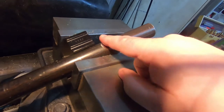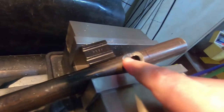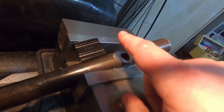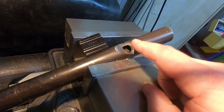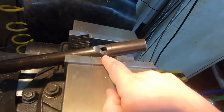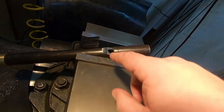Came out looking pretty good. I'm still really loving the roughing end mill I've been using. The cuts on the sides, you know, they have the striations, but the end mill cuts are actually quite nice. But I do have to change that out because next I need a gap of a quarter inch here, and this is a half inch end mill, so can't do that.